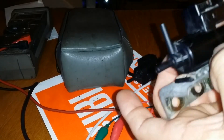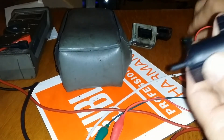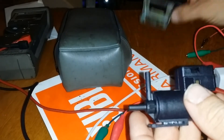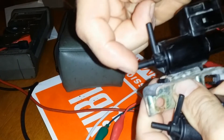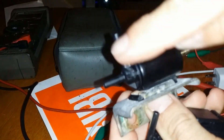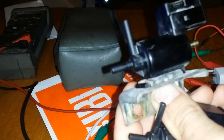I did take some time and try to clean this out with some cleaner, and also I blew compressed air through it. I guess over time after I blew the compressed air, it loosened this one up. I blew the compressed air in through here, and also in through here. I think this side is normally open, and when I blew it through here, that forced the solenoid back the other way and allowed air to come shooting out.